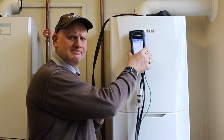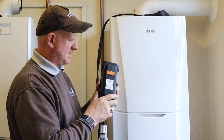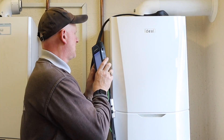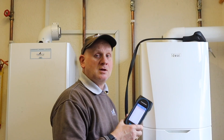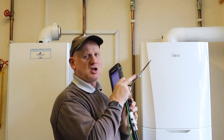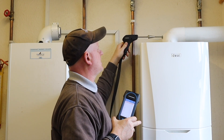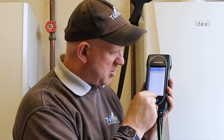There's a problem with this boiler — it has a plastic cover. The analyzer has two big magnets, but they won't stick to plastic, so they stick to the metal on the side instead. That means I'll have to hold the analyzer while doing these tests. Now I can get the probe into the boiler — there's a little stopper ready for going into the products of combustion sample point. I'm turning on the hot tap to fire the boiler up.